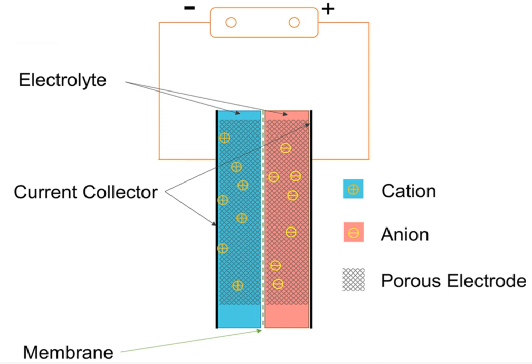However, ruthenium is expensive and the 2.4 volts voltage window for this capacitor limits their applications to military and space applications. Das et al. reported the highest capacitance value of 1715 F per gram for a ruthenium oxide-based supercapacitor with electrodeposited ruthenium oxide onto porous single-wall carbon nanotube film electrode. This high specific capacitance of 1715 F per gram closely approaches the predicted theoretical maximum RuO2 capacitance of 2000 F per gram.